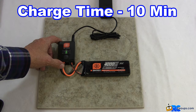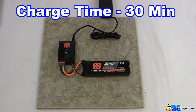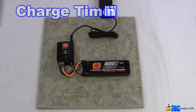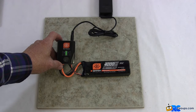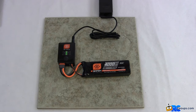We've been charging about 10 minutes and we have two lights solid, with the third light blinking. At about 30 minutes we have three solid green and the top one is flashing. At 43 minutes it's fully charged — all four green lights are solid and it's giving us that two-tone beep letting us know it's done. So 43 minutes is a lot quicker than 5 hours and 45 minutes on the USB charger.